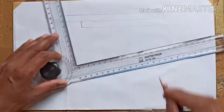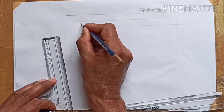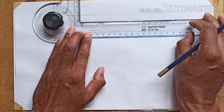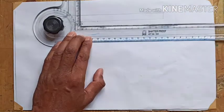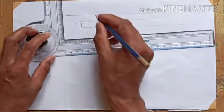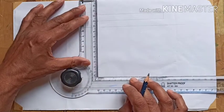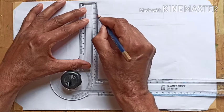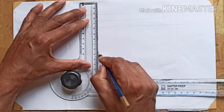We give the angle of bevel at the edges of the plates — this is 10 degrees, also called a beveled edge. Now we can give the margin from this beveled edge. The margin we already calculated is 30 mm, and at the margin location is the center of the first rivet. We can draw a dotted line there.